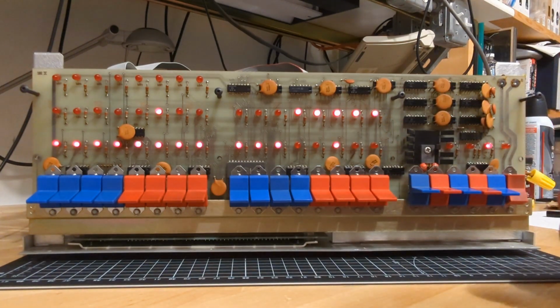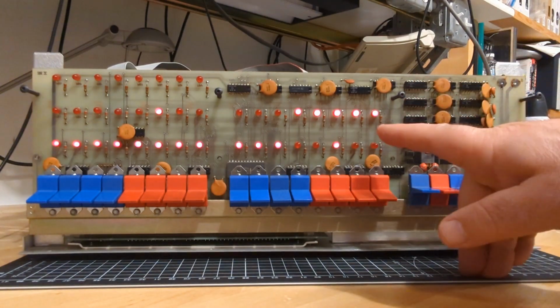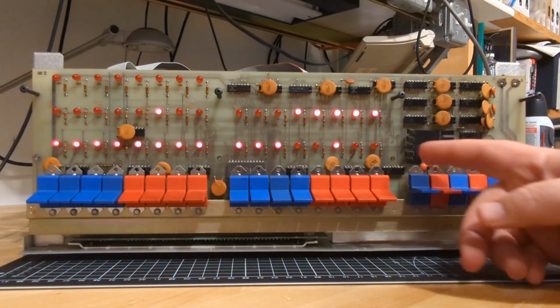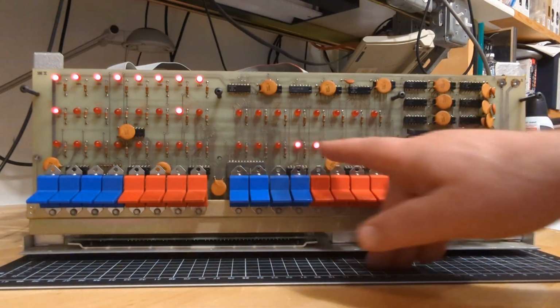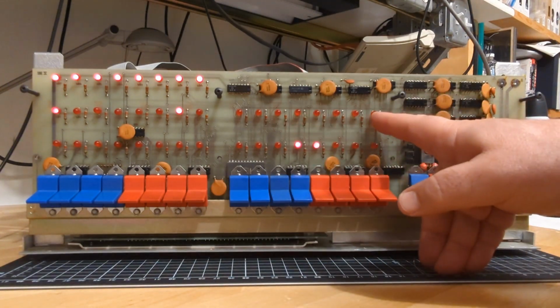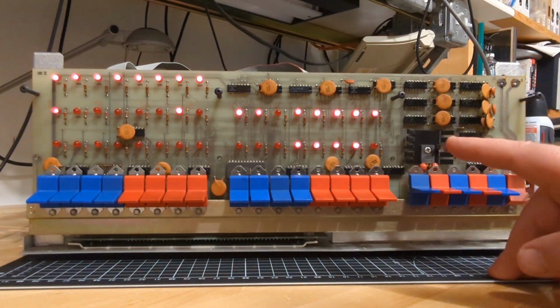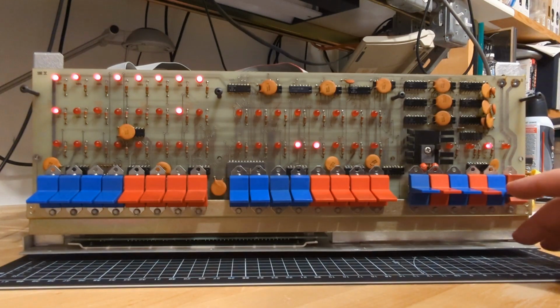And this would be the address of where to return to, or more accurately, this is the low byte, least significant byte, of the address of the opcode following the restart instruction that caused it to go through this song and dance to execute the restart. So then we go to the restart handler, and we're back to this again. Now, in contrast to what was happening during the pushing operations into the stack, we're now seeing data read from the memory card as opposed to data that is being read from the CPU. So what I believe here is that we can see data right now from the memory card, and we can see data from the CPU,